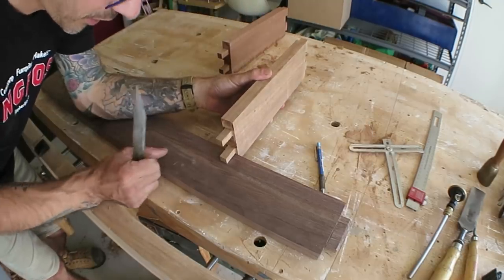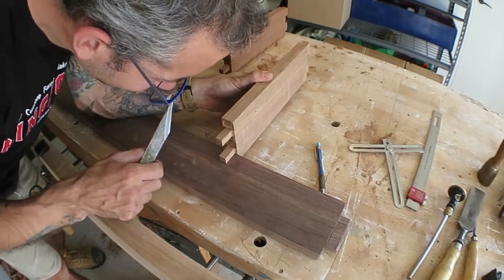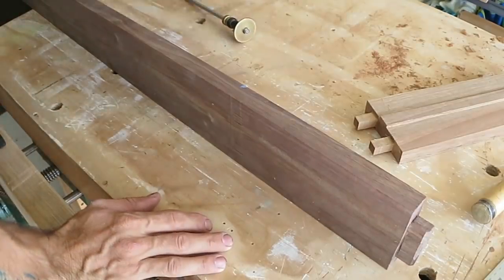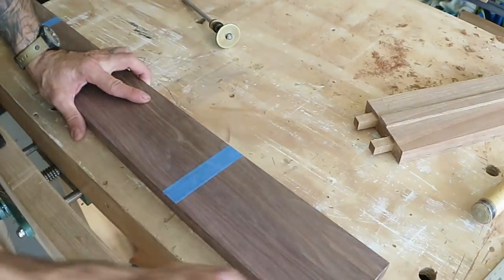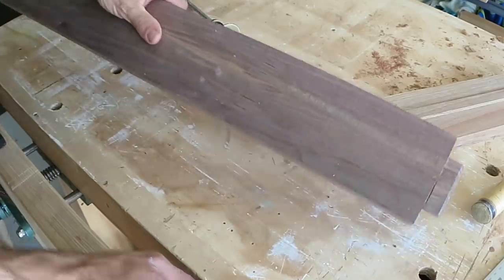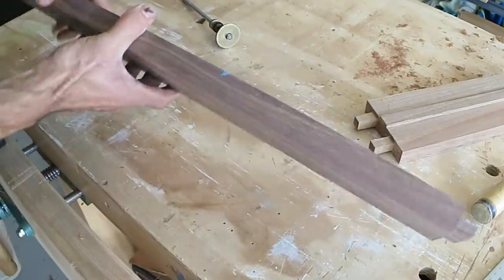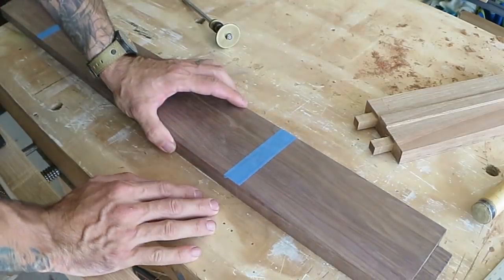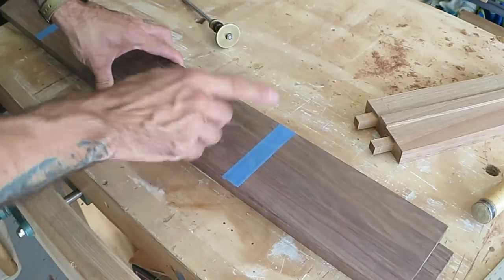So I'm just going to scribe where the tenon is. Okay, so the hardest part about this kind of joinery is making a nice clean hole on the show face. I'm not too worried about my marks. It's probably hard to see them, but I've got scribe lines and stuff everywhere on the inside. Doesn't really matter. On the outside, I really want to avoid scribe lines too much if I can. So at the moment I've just got pencil lines where the tenon should be